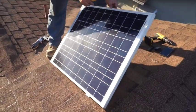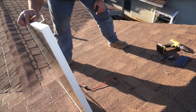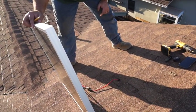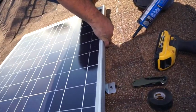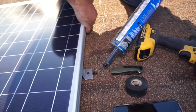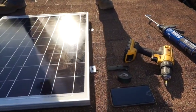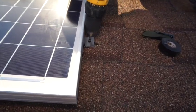When you take it back up, you're going to see your brackets and put a dab of roof tar on it, then go ahead and install the screws to attach it to the roof. Now that you've marked your holes, put a dab of roof tar on each one. If you have roof tar coming through all the holes, you know you did it right. Now you're ready to install the solar panel with your screws.